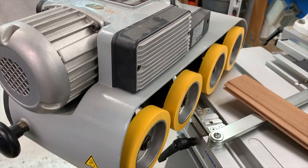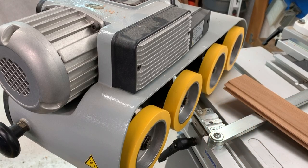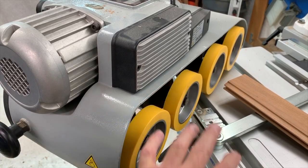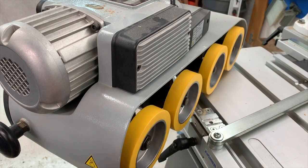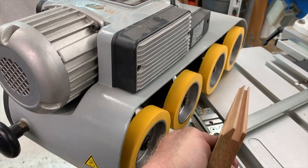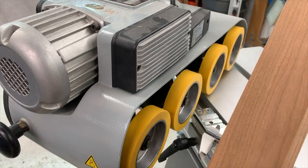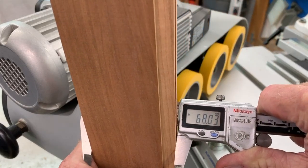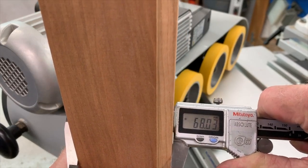You can see the narrow tire set up on my feeder — this is the standard width tire. You can actually run these on the inside or the outside, or in tandem with two tires per spindle. This is a Comatic feeder. Here's our profile piece — I've checked it, it's flat, straight, etc. Let's see how we did on final width: 68.03 millimeters. I'll call that good.